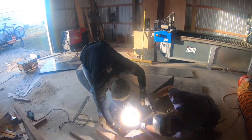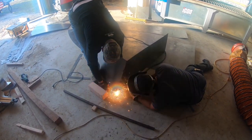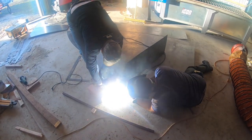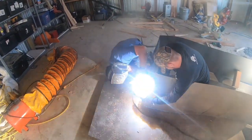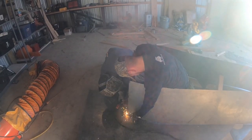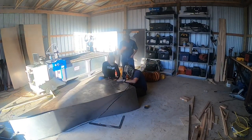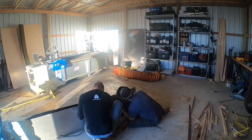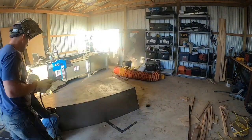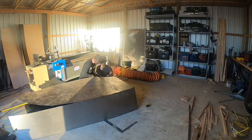There was a ton of welding on this project, and it wasn't very much fun because of having to weld a 20 gauge. Now, I think that it would have helped if I would have bought some 5/64 welding rods. I ended up using 3/32 because that's all I could find around, and I was going to have to special order the 5/64, but in retrospect, I wish I would have just ordered them. It wasn't too bad welding the areas where there was 16 gauge though. I didn't have any issues on those spots.